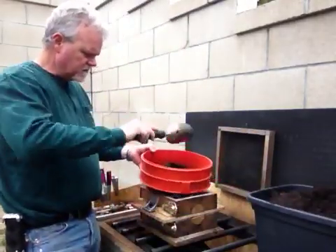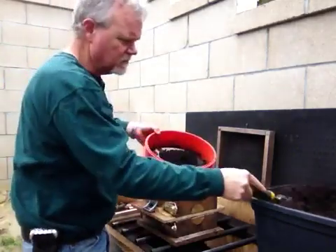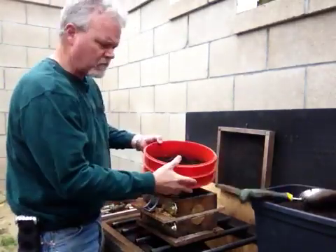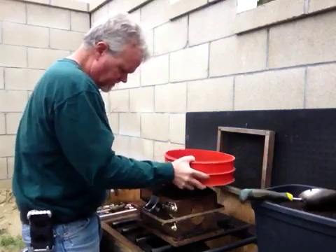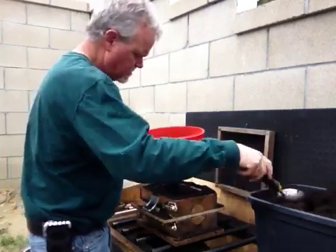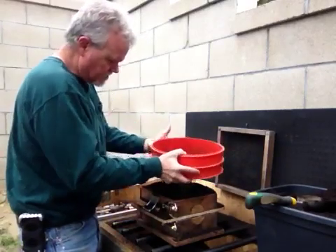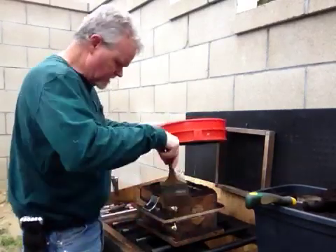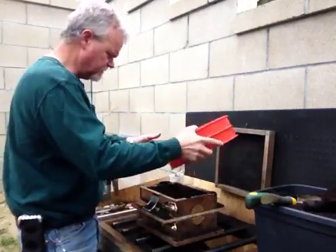Now this is a fine grain sand with clay and oil. It's called Petrobond. I get a light coating on it first because I want it to go through the sifter and get all the nice fine grains on the surface of my piece.